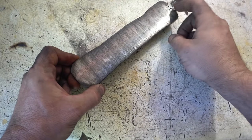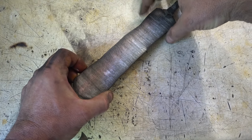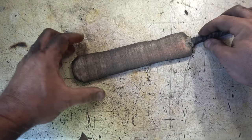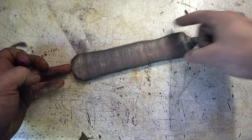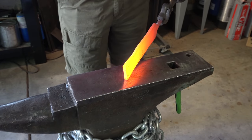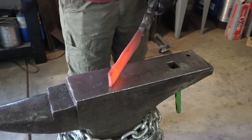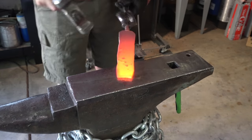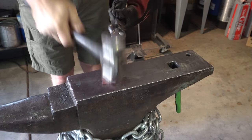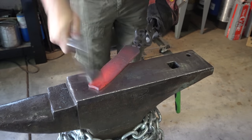So this is really centered in the billet, which is great. This is going to be my tang, and this is going to be the tip. So what I'm going to do is actually just forge down this part a little bit to get a little length that way. I'm going to forge the tang down and flip this so that this is my tip. Here this is a lot of hammer work just to finesse the profile a little bit — I want to do this on the hammer and not on the press, just so I don't open up any more splits along the side of the billet. I'm trying to taper that point, making sure to hit both sides evenly just so that I keep the center of the feather in the center of the billet.